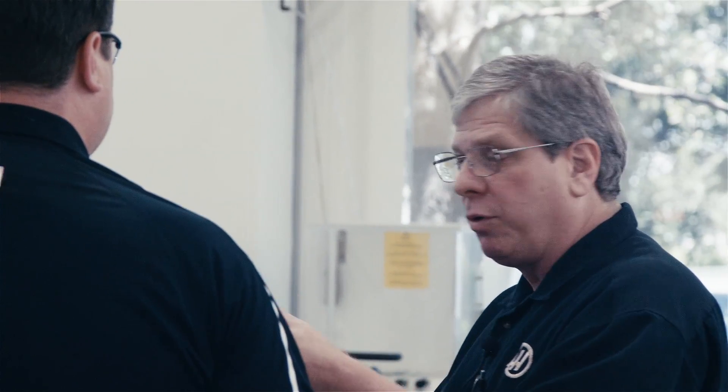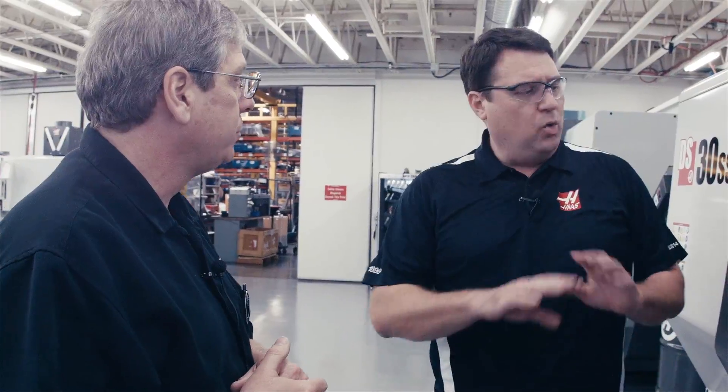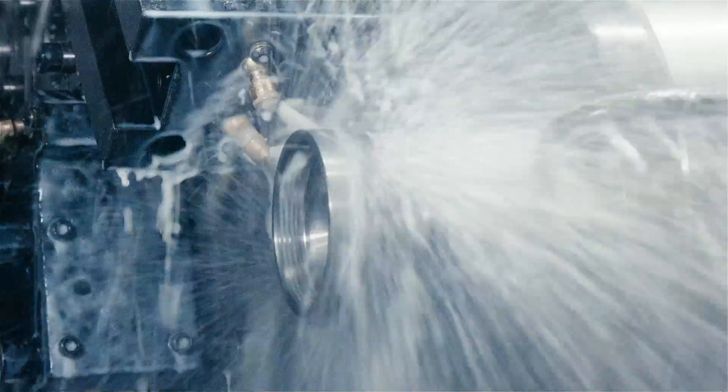G14. Essentially what G14 does is mirror all of the Z-axis motion and any spindle commands that you've given. So essentially you can take a program that was written for a single spindle machine for operation one, flip the part over and program operation two. You can take those two bits of code, put them in this machine with a G14 in between, and the machine will take care of mirroring all the motion over to the second spindle. So I just program like everything's on the main spindle — exactly, whether in your CAM system or by hand, a single line of G-code mirrors it all to the other side.